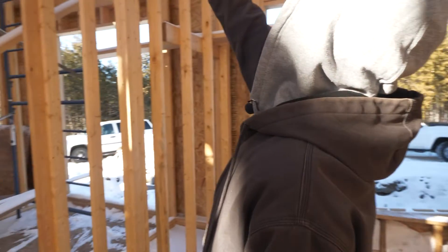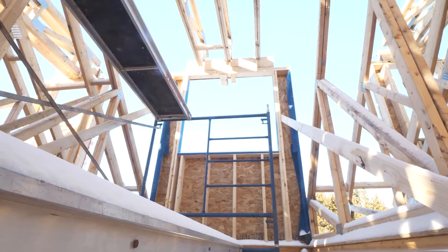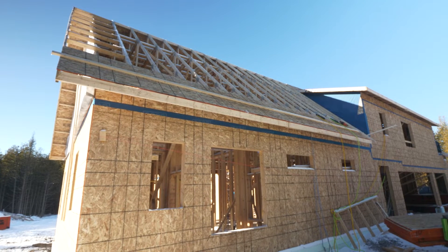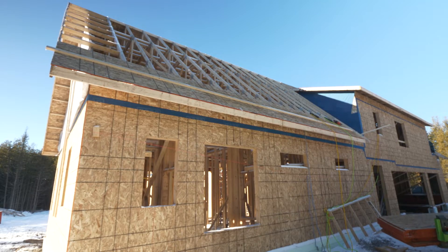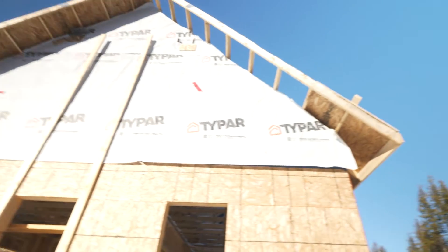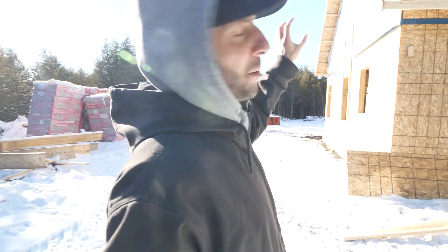This area is going to be open to above, so you can see the Adhero comes wrapped around that dormer. We'll have to sheathe that wall, do our Adhero, then sheathe the roof to keep the air barrier continuous. On the outside you can see the Adhero — our air barrier — on the side of the dormer because the inside is conditioned space. Over on the gable it's an attic, so the air barrier doesn't go past the attic; we just use a standard Tyvek weather barrier on the gables.